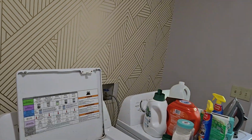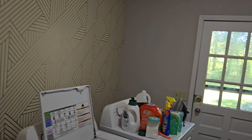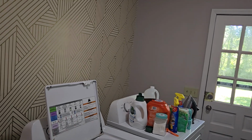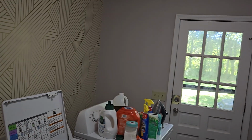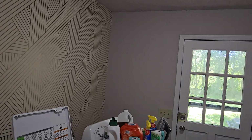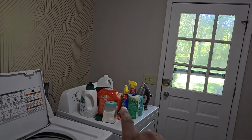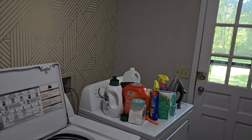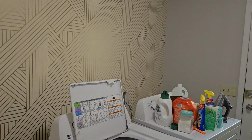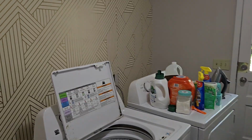And then as far as the wall cabinets go, we do also want to make these wall cabinets 18 inches deep instead of your standard 12 inches deep. This will do two things. One is it gives you a little bit more storage inside of these wall cabinets, but two, as long as we make it 18 inches deep, then we get to hit an extra stud, which your studs in your walls are typically centered at 16 inches on center. So that means we'll be able to have an additional stud on the side, giving you additional support inside of the front of your cabinetry, as well as having just a little bit more depth so we can store all the items that we need to, the dryer sheets, the irons, etc., soaps inside of those cabinets with that additional support as well. So that is going to be something that we do suggest there.